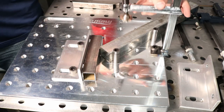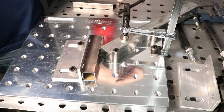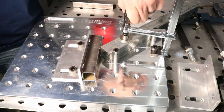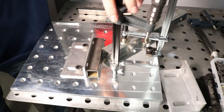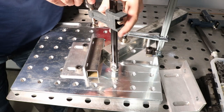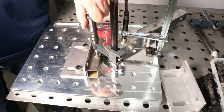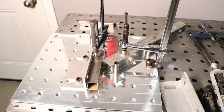Putting everything together, I've got some of those pins in place with one of the stops. Using some scrap material, you can imagine putting together a short production run of small parts — use the bigger clamp, thread in some of the smaller bar clamps, have the references down on the bottom, and get everything cinched in place. It's nice and repeatable so you can make several parts confidently. Thanks for tuning in — projects like this really pay off in the long run. Hopefully you found some ideas you can use in your shop, and we'll see you next time.